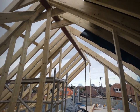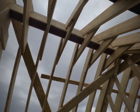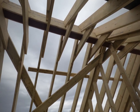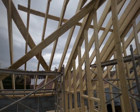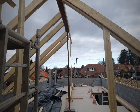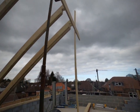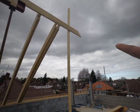As you can see, the ridge steel that I was talking about is in place. That's been webbed out and then a nice big 8x2 ledger locked each side to it, and our ridge is an 8x2 set on top of that. Like I said in a previous video, the length of this building is around 15.5 metres external, so we've done a nice 50-degree splice there.